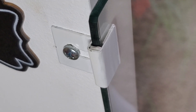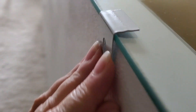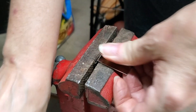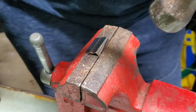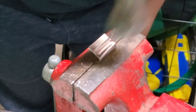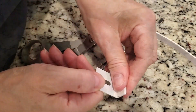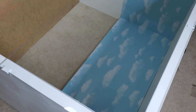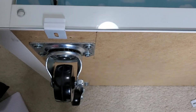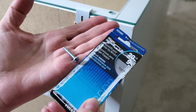To attach the bottom cage glass I had to modify the upper mirror brackets to get the glass flush with the wood so there wouldn't be any gaps. I used a vise to flatten the bracket into an L shape, a hammer to make a fold, and a chisel to make another fold and hammer it into shape. I only had to make two of them. To protect the glass I cut strips of foam sheet and put them only where they touch the glass. I laid the cage on its back, set the glass on top, and put the brackets in place — making sure to put them on the ends where the solid wood is. The center Ikea bracket mostly covers one of the holes in the glass.